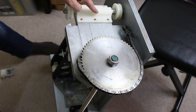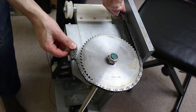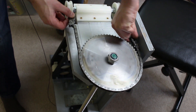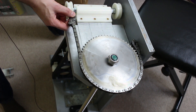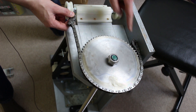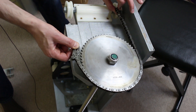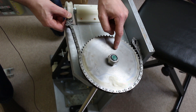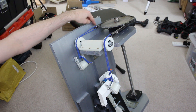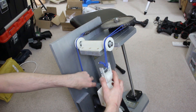It runs pretty well. I've screwed this piece on and put the chain on, but from the top I only get this much motion before the chain hits the pulleys — I pretty much knew that was the case. Something flexible has to go around the pulley. If I'd run steel cable wrapped around the pulley with an anchor, I could have gotten more motion, and I might change that in the future. For now I've tied some paracord onto the chain — it's not ideal since the chain will eventually cut through it, but it'll do to test.